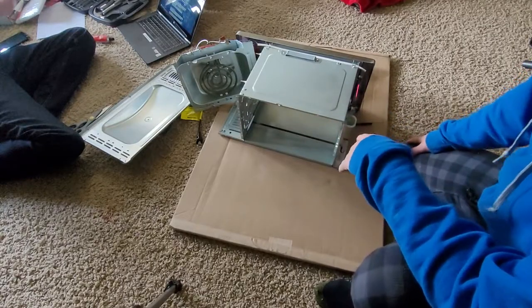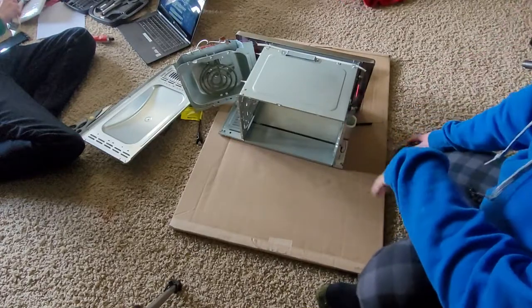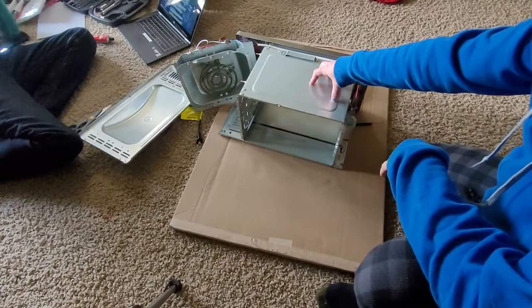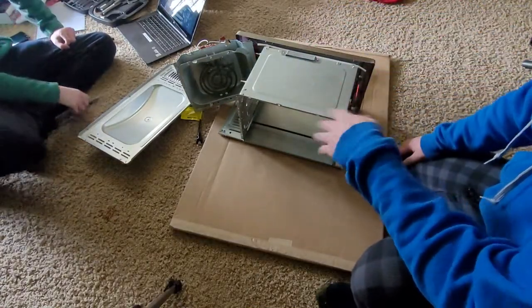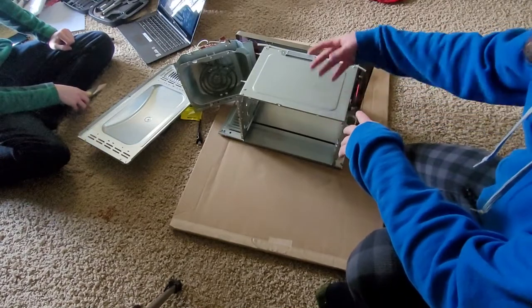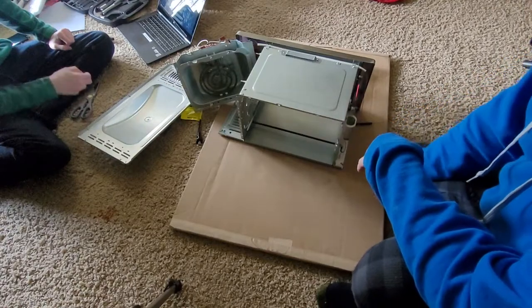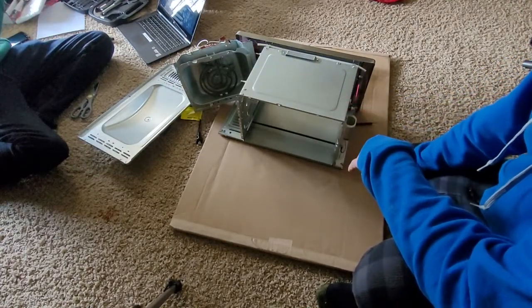So this is the oven to SMD oven conversion we're going to do. This is a convection oven. A lot of people just use normal toaster ovens, I guess it's a convection toaster oven, but we want this one to help the air flow around better inside the oven. You'll notice that if you just have the top and bottom elements, you have to be careful where you put the parts, otherwise it'll get certain spots hotter than others.